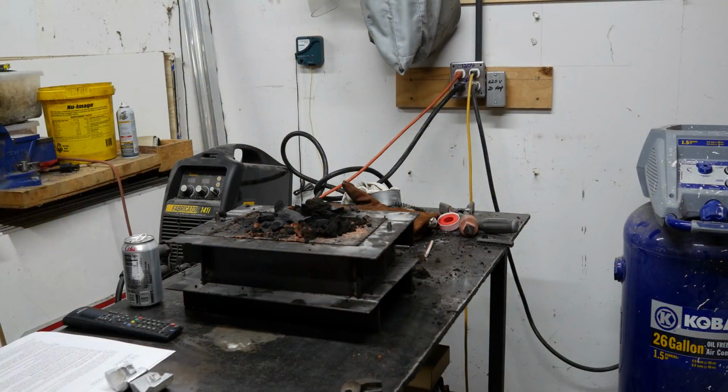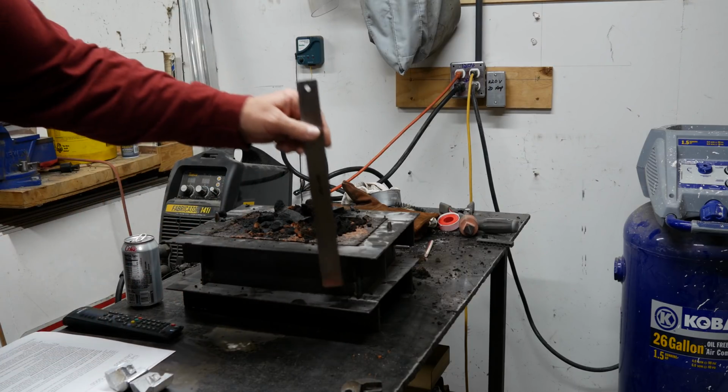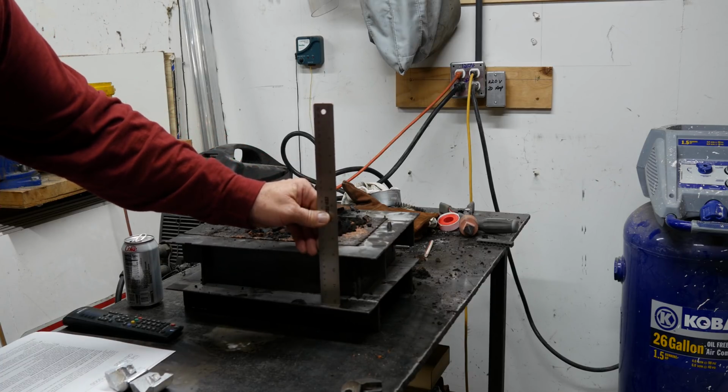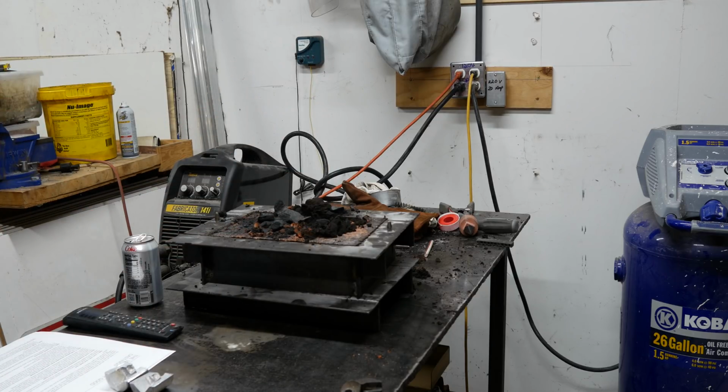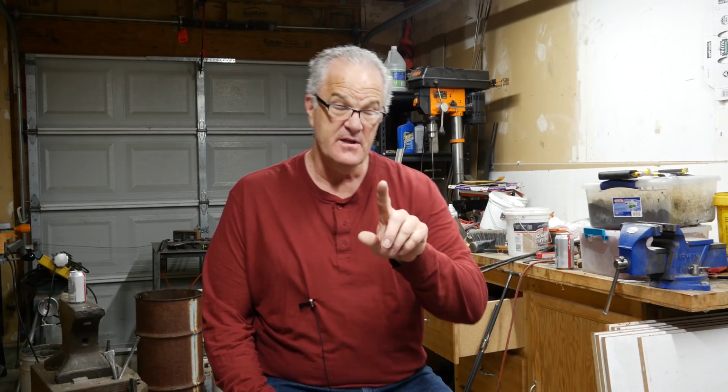Here's the deal. My flask, let me just point it over here real quick. All right, this is my cope. It's upside down right now. I just emptied it out. But it is right at 80 millimeters. You may not be able to see that, but it says 80 right there. That's how tall my cope is. And as a result, my sprue height is about 80 millimeters. Not 50 millimeters. But that's okay. Here, let me tell you why it's okay.